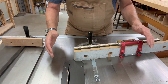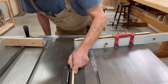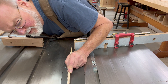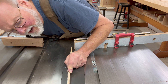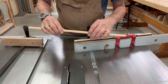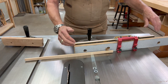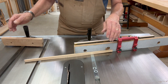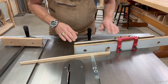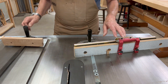The first thing that I did at my table saw was adjust my blade so that it is precisely protruding above the table one half the height of my braces. Now you want to get this accurate, but if you miss it by a little bit, stay below the halfway mark so that you can tweak that — you can manage to do that quite easily. So I've taken my miter gauge now and I have adjusted its angle to match the required angle. In my case, the angle of the X brace is 100 degrees, so I've set that up here on my miter gauge. This is a slick exotic one and setting 100 degrees was a simple matter, but not to worry.